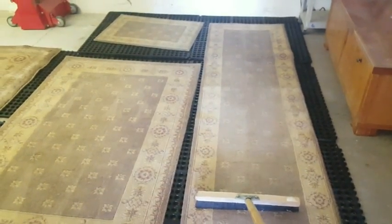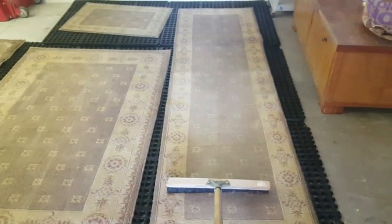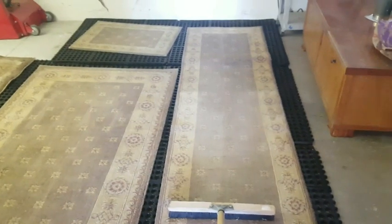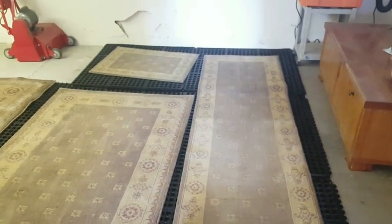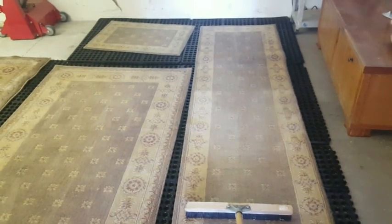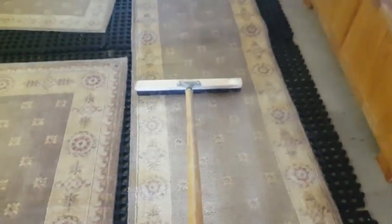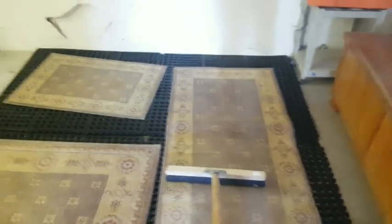After a good thorough extraction, the last step I typically take: grooming the fibers. On polyester carpet it isn't crucial, but if you're dealing with viscose or other crazy nap carpeting, however the pattern is set when it's wet is how it'll be set when it dries — and viscose is very annoying if you get a weird pattern because it won't come out unless you moisten it back down, brush it out, and dry it again. So we take the broom and make sure the nap is set exactly how we want it. Regardless of carpet type, we just get in the habit of doing it — better safe than sorry.